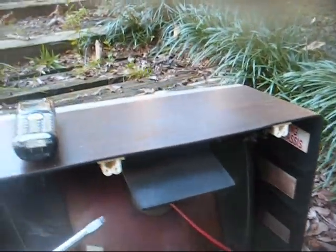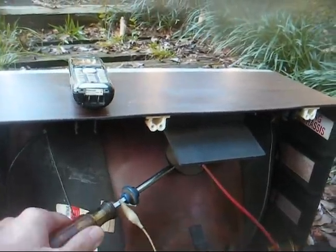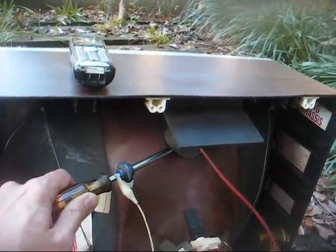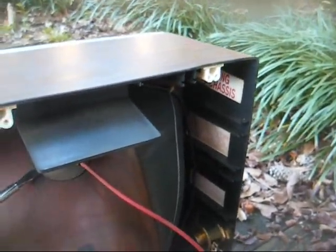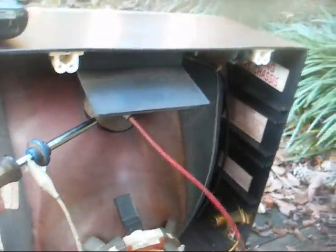Yeah, I heard a little pop there. Now, you do it one time and you do it again, and it's best just to let it sit under there for a few minutes, because sometimes these tubes will recharge. So we'll just let that sit a minute or two. Alright, that's good. So we'll pull it off, slip it under there again, and if I don't hear another pop, come on, get under there now. Alright, good. No pops. This thing should be discharged.